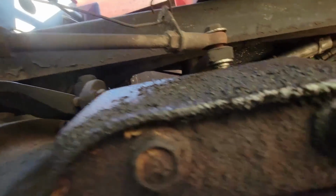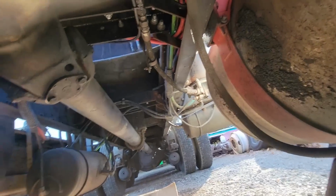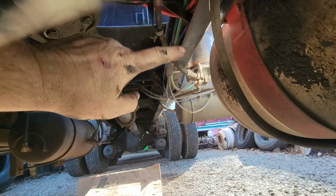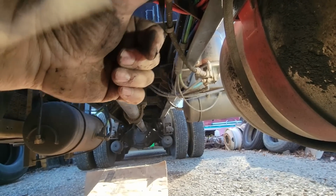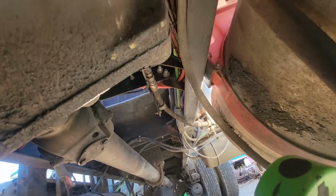And our liner comes way up here. Our liner is 7 feet long, and our splice, this is only a 10-inch frame. So PACCAR, I think they want for every, whatever the height is, you take that times 2 each way. So this is a 10 1/4 frame, so you'd go basically 20 1/2 and 20 1/2. Well, that's only 41 inches. We're 84 inches. We're well beyond, and I'm happy with it. It's working out just fine. Plus, we did the outer frame layers. You can see right there.